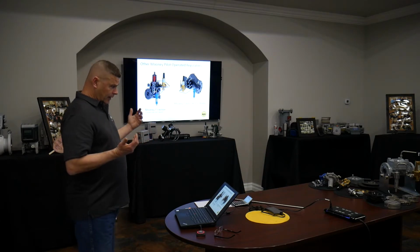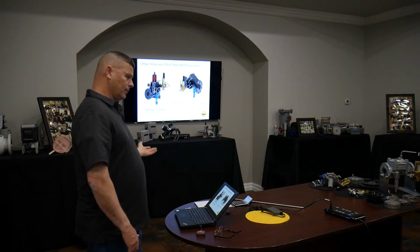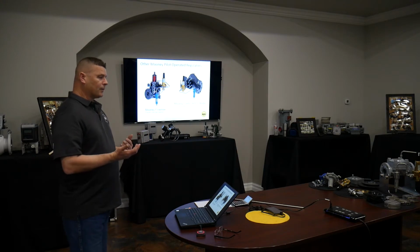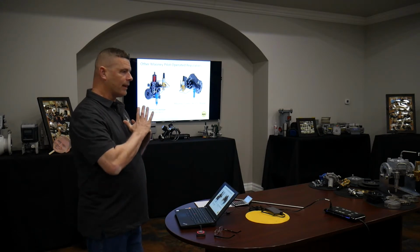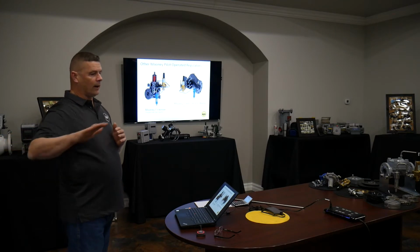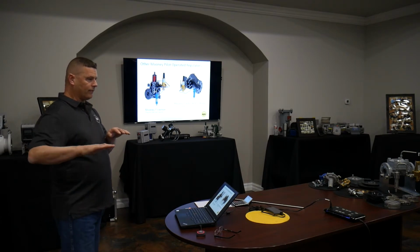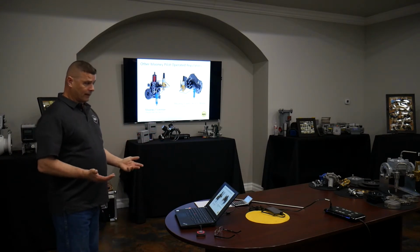And the other thing is, you get these customers that say, when I have only 200 pounds on my system, I want it to deliver 200 pounds downstream. Well, what they're asking for is a pipe at that point, not a regulator. The flow grid is not a good pipe, because it's going to take a certain amount of differential pressure to get that flexible element to lift off the throttle plate and allow the amount of flow that's required downstream to get to those loads. So there's always going to be a pressure drop in those situations where they're so close to where they really want to feed if the inlet pressure is already there. So Flowmax is way better at that, as an example.